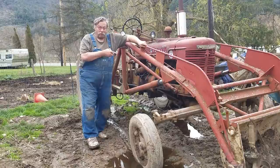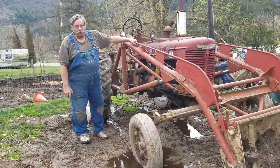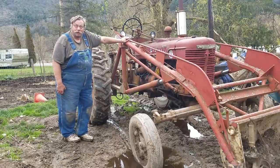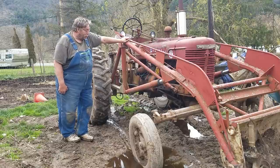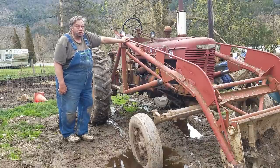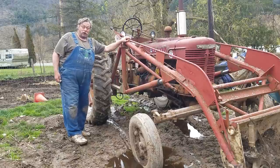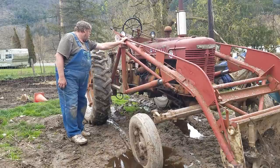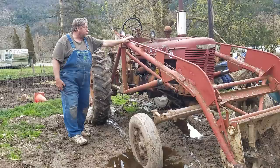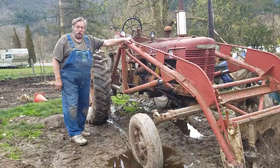This small tractor is gonna move my dirt to the greenhouse. This old girl runs so good just the way you see it. I don't know how long I've had this - 12, 14 years. When I got it, it looked like a brand new tractor. Of course they use tractor paint - the cheap stuff, so they fade. The fella put Super H emblems on it and it's not a Super H - they never had one that early. But I'll tell you what it did have - brand new tires all the way around when I got it, and the motor's brand new, new clutch, everything. I've never done anything but replace the coil, the battery, and the points. That's all I've ever had to do to this.